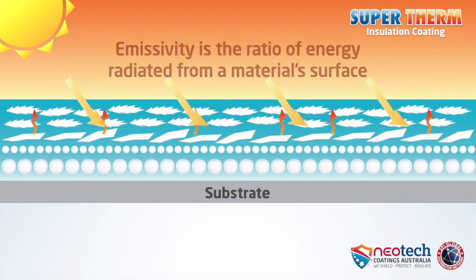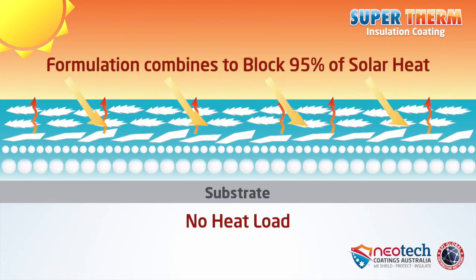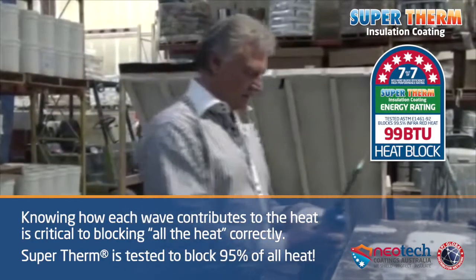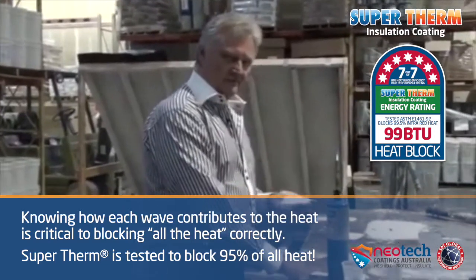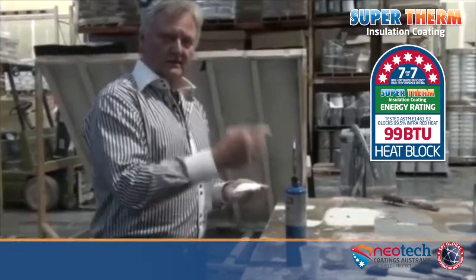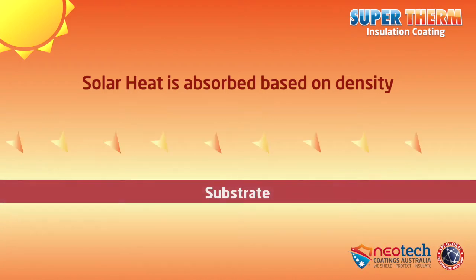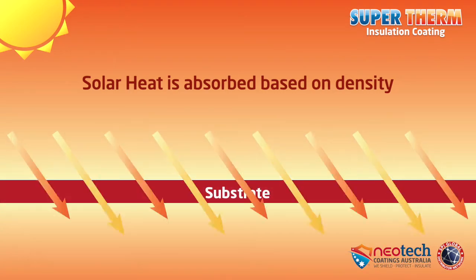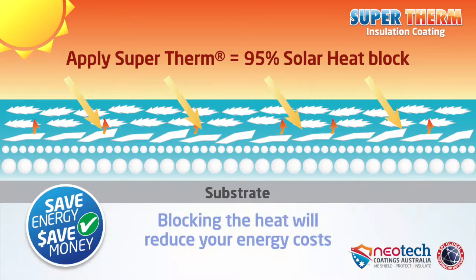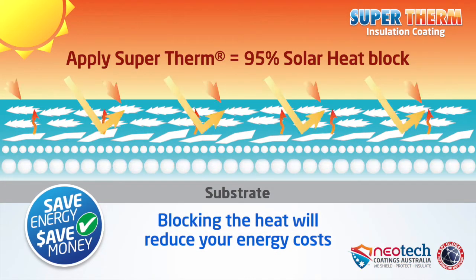Emissivity is the ability to throw heat off of the surface of the coating, and in our instance also not to load heat into the coating. Meaning that, for instance, this is a metal top right here, and if this metal top, like your car hood, could absorb heat, even though it's a white car, it absorbs heat, so when you touch it, it's hot. Burn your hand, because it's got density and it absorbs and holds the heat. A piece of paper, you touch it, it's warm, but it doesn't have the density to absorb and hold the heat.